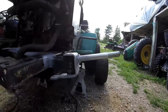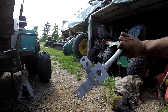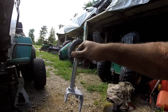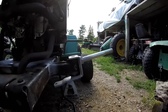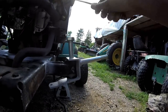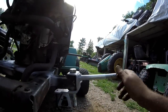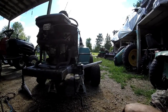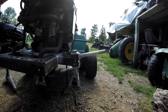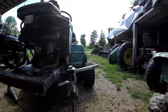Hey guys, I got one side done. That's what it's supposed to look like - it all aligned. I got a three-quarter inch bolt, about six inches long, and it slides on there nice and easy. Then you take another bolt and shove it down in - nice tight fit - and it pivots nice. They're going to have a nice rake to it. I think it's about 22 degrees I put in. I'd like a little bit longer bolt to make it wider, but what are you going to do. I'll do that side now and be right back.